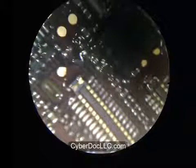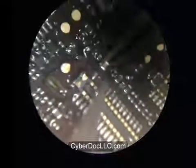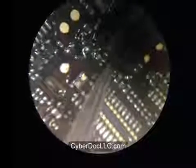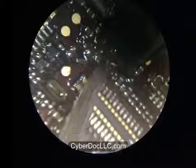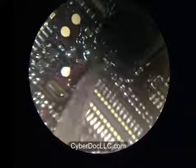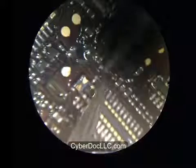Okay, let's get started. Now the pads are cleaned and cleared. You can place the new backlight filter for iPhone 5. 3 of them. Placing filter number 1. It doesn't need to be the exact location, but it just needs to be approximately attaching to the solder pad. The heat will do the rest.